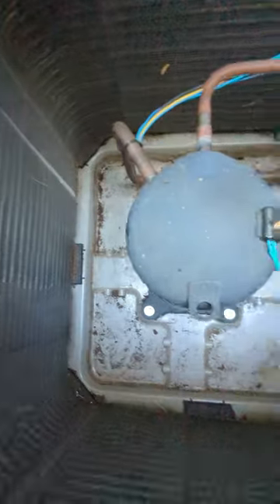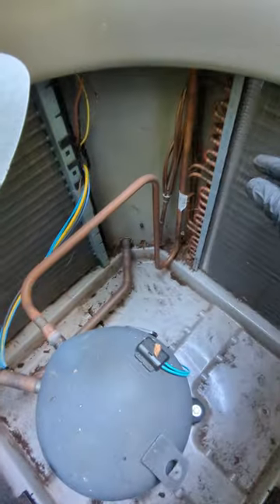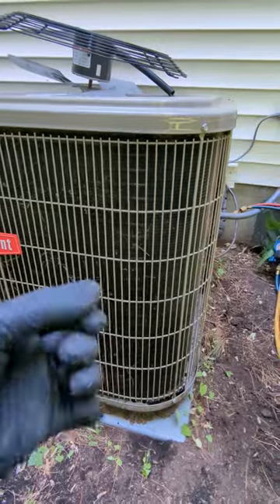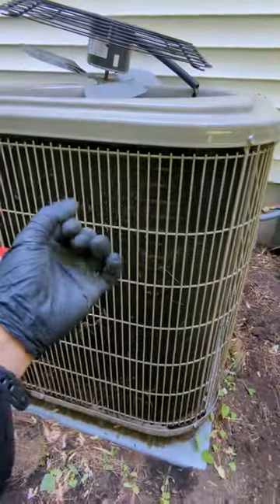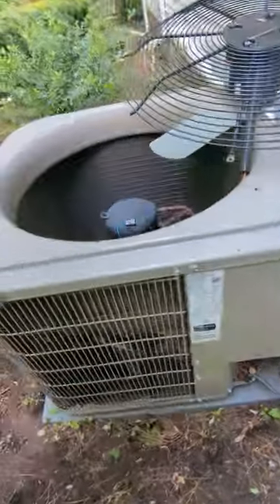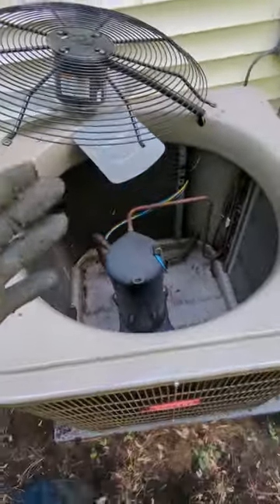This is just a short video. Since you already have it open like that — see how quick it is, it was like two minutes and it's clean — you can spray this with foam coil cleaner. If you watch my other videos I have the brand I use for condenser cleaner. You spray foam on all of this inside and also outside. It's not spray foam like expanding foam — it's a condenser cleaner that goes in as liquid and bubbles up like foam, loosening all the dirt. Once it's all cleaned up, put the cover back. It's just basically the reverse of what I did.